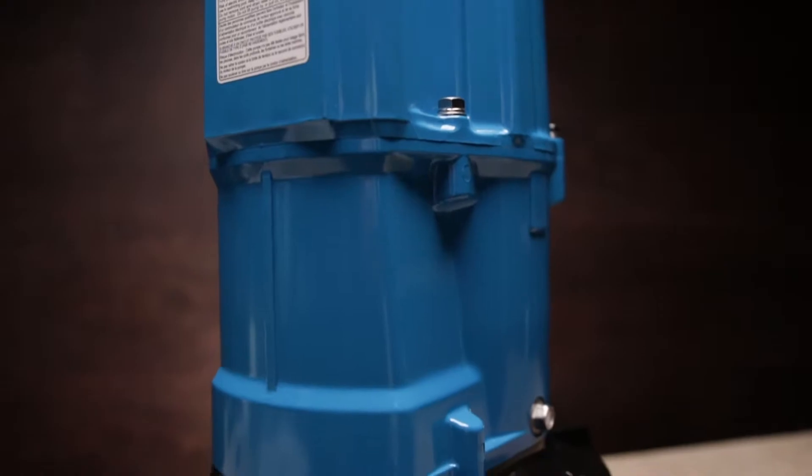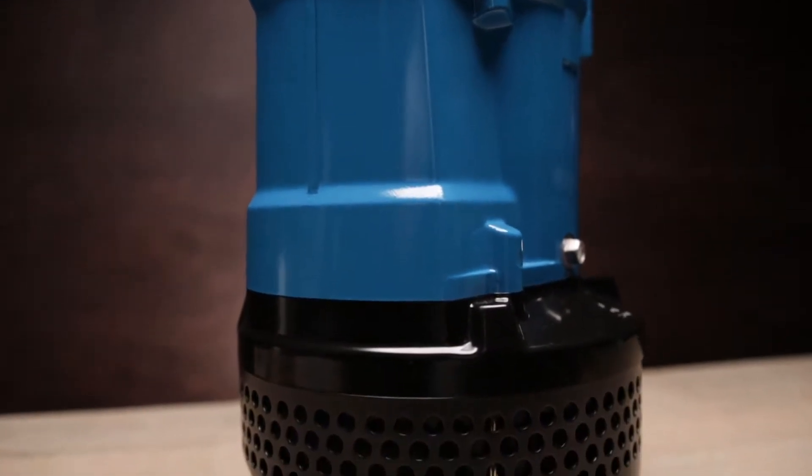It operates most efficiently pumping 60 gallons per minute at 45 feet of head and can run continuously when submerged 24 hours a day, 7 days a week. The NK2-15SK is a small beast designed to demolish the toughest and deepest dewatering applications containing sand, slurry, and small debris under a quarter of an inch or 8 millimeters.